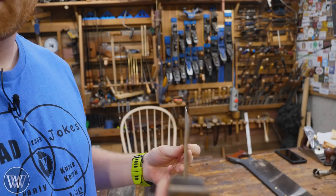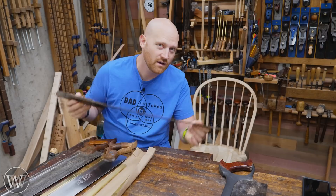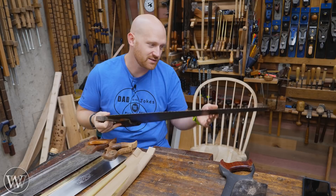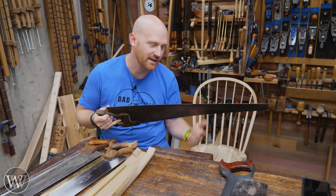Now you can look down that saw — yeah, that's what we want. Really nice and straight and clean. With panel saws and hand saws, it's just that easy. They're made out of spring steel, so you can really crank them around. A lot of times you have to bring the tip all the way back until it touches the handle. You're not going to hurt it as long as you're doing a consistent bend — you can bend it one way and then back the other way. If you bend it too far, just bend it back and it's not going to hurt the plate at all.